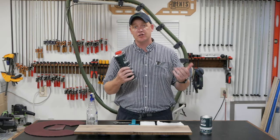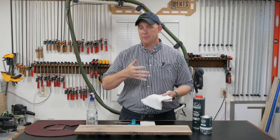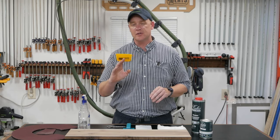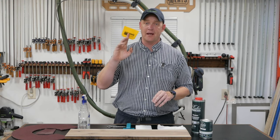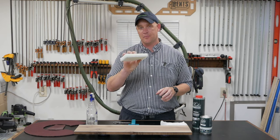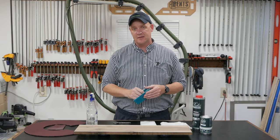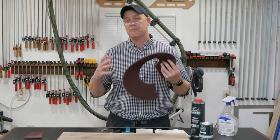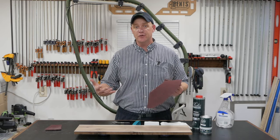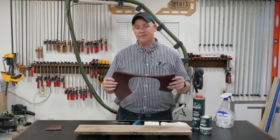This is their raw wood cleaner, used to clear off all the dust or debris from the wood prior to applying your finish. To wipe the excess down, I like to use terry cloth towels, which you can purchase at any home store in a huge bundle for fairly inexpensive. I'm going to show you two different ways to apply it: the traditional way using one of these spreaders — this one is by System 3 and you can buy them in variety packs — and on the other half, I'll show you the technique we used for my table, which uses one of these white applicator pads with an application pad block. I'm also going to take you further and show the process that raised the most questions: adding a second coat, and I'll walk you through those steps.